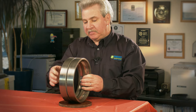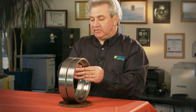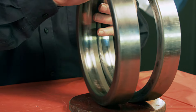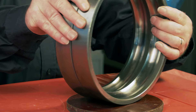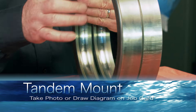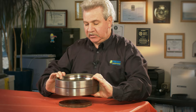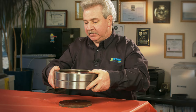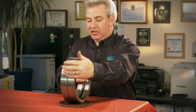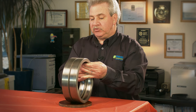Taking several pictures means you'll never have a problem installing the bearings back together. So we've done face-to-face and back-to-back. When we turn the two bearings so that the thin side is to the fat side, these are both thrust bearings in tandem — it could be both thrust down or thrust up. Showing a photo with the back and front alongside the mount would confirm that these are both in tandem, in one direction or the other.